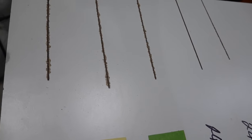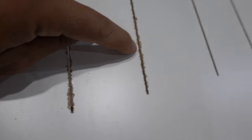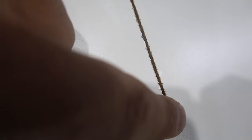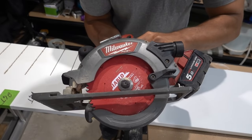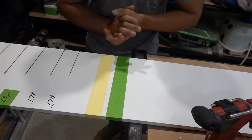You can see there it's a much better cut, but it's still not perfect. Looking at all five different methods: number one, 24 teeth no tape - complete blowout. Tape and tape - complete blowout. Multiple cuts was pretty good to be honest, especially on a 24-teeth blade - we did have a couple of little chips which still probably wouldn't be acceptable. And then with the scrap piece compressing down the material, it just didn't have the opportunity to completely blow out - maybe something denser might have prevented those little blowouts. Now we're going to swap over to the 60-teeth blade and see just how much difference there is.